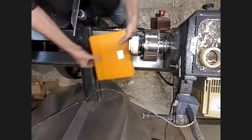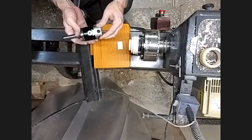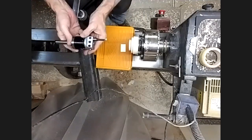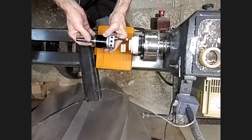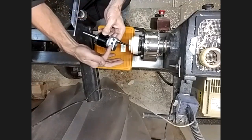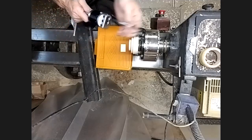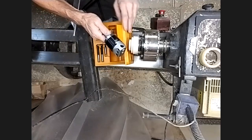Boring heads are really cool. But that goes into your live center. That's your adjustment, put your cutter in. So the live center, you know, determines the feed rate, going inside to clean something up. And we have an adjustment on the side that will shift this cutter over a fraction of an inch at a time. So this is, I already have one. It's a fun toy for bangles, anything like that, rings.